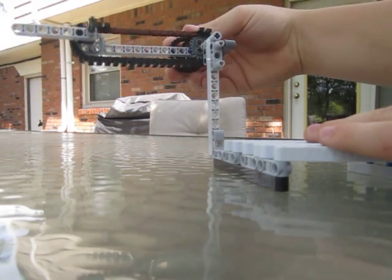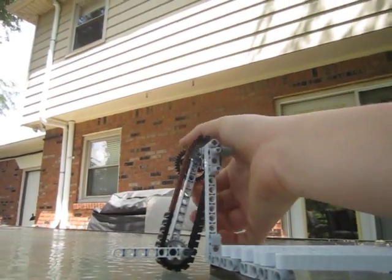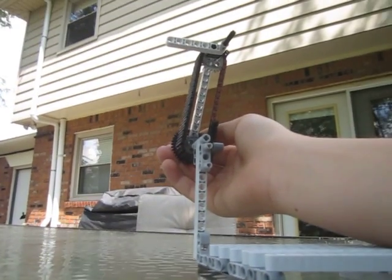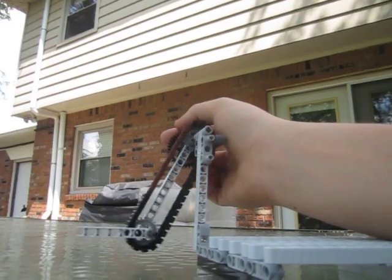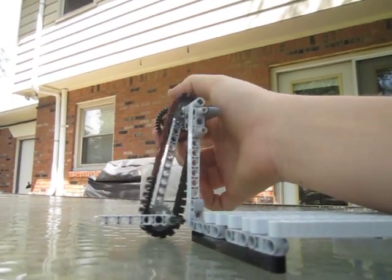See, it's staying the same angle. That's the benefit of the chain bar — you can attach your hopper to that bar and your intake will stay the same angle all the way up and down.